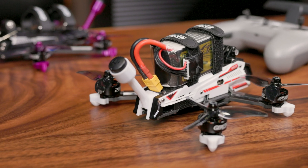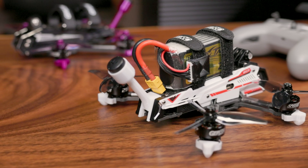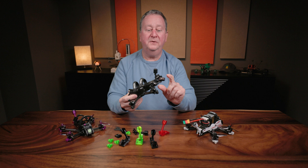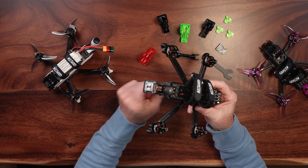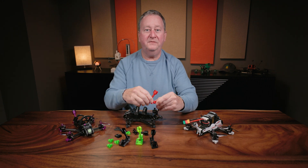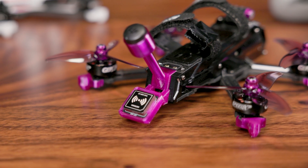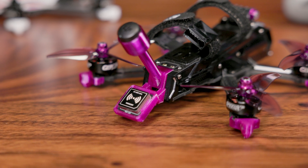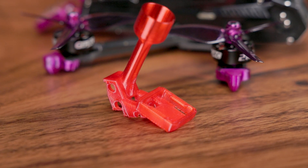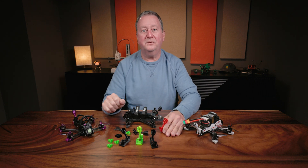This one is designed for a PNP, or plug-and-play, like I have here on this one. I also have one with a GPS unit too. The factory GPS is a bolt-on and can get down at a weird angle, and then it will never work properly. So what I've done is I've made it a fixed position — the antenna is at 30 degrees and the GPS unit is at 30 degrees, and it's fixed. I've also put a notch in here if you're running a conventional receiver so you can put your T antenna in it. That works really well.